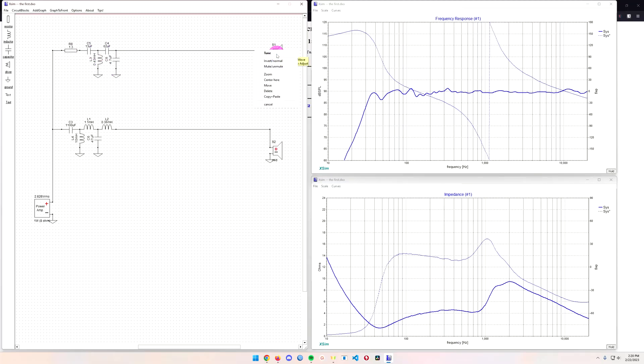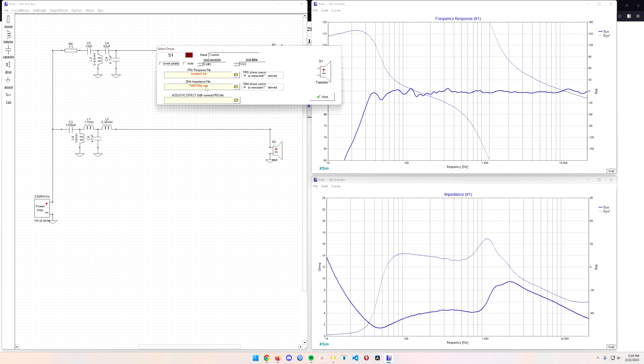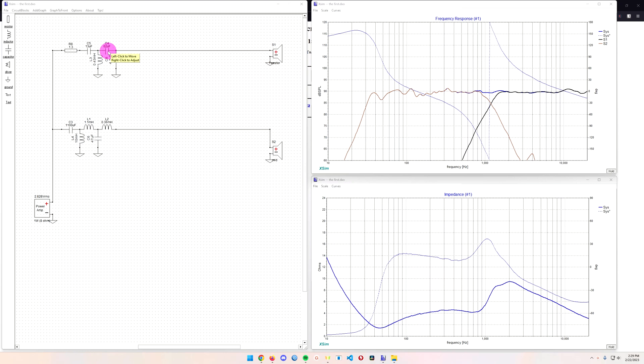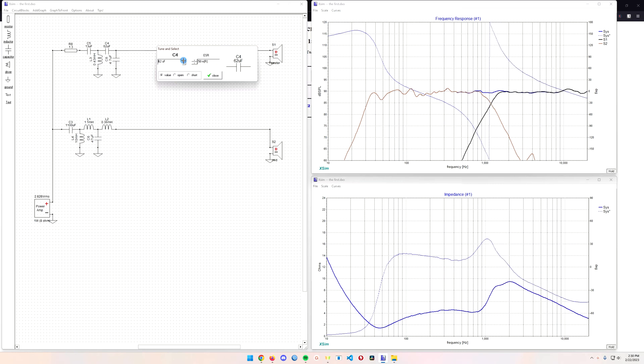For the rest of the design, you can see the speaker components here. If I click on Tune and go to the tweeter, I imported FRD and ZMA files so I can actually view the response curve. With the tweeter and bass driver curves overlaid, you can see a nice clean crossover point and a fairly flat response. What I really like about XSim is that as a total newcomer, you can click on any component, hit T for tune, adjust the value up and down, and see exactly what that change does to the overall frequency response curve — extremely beneficial.